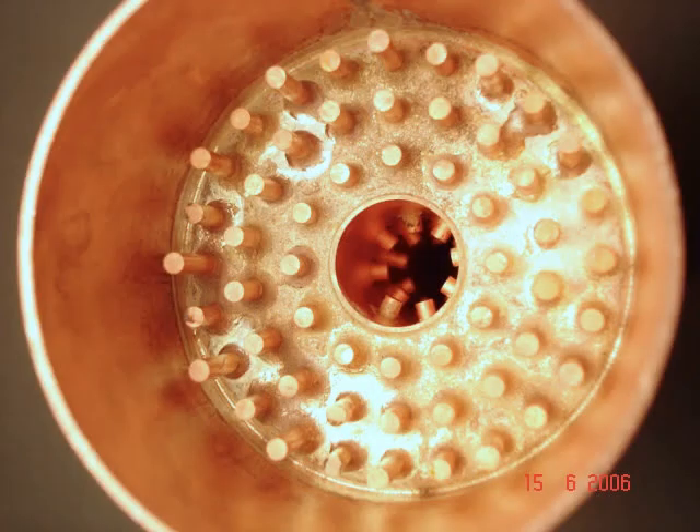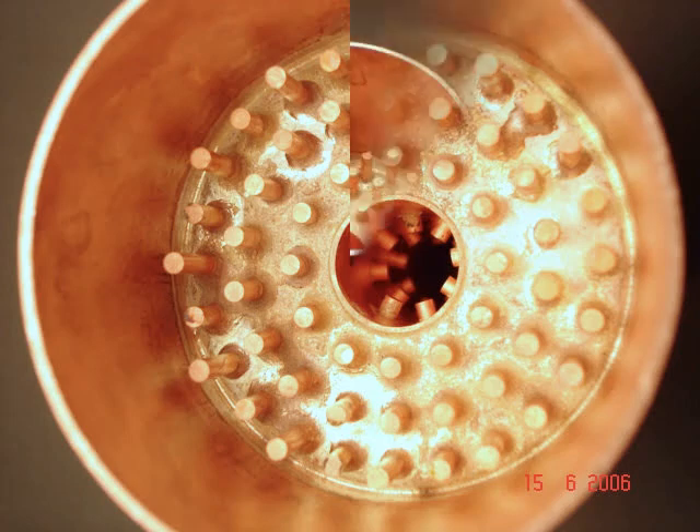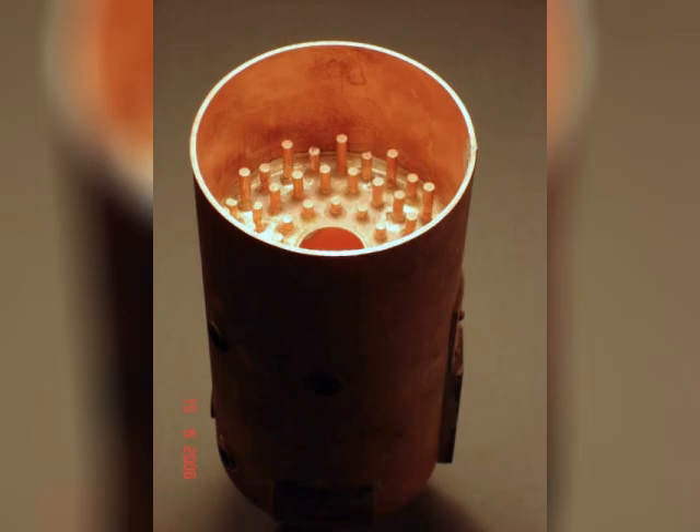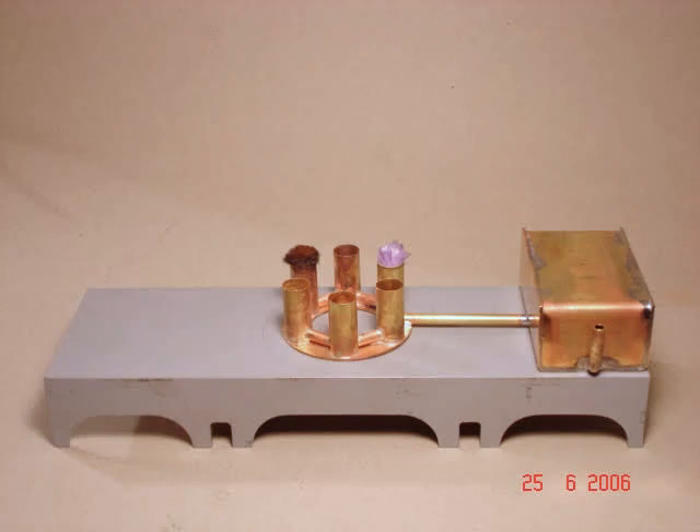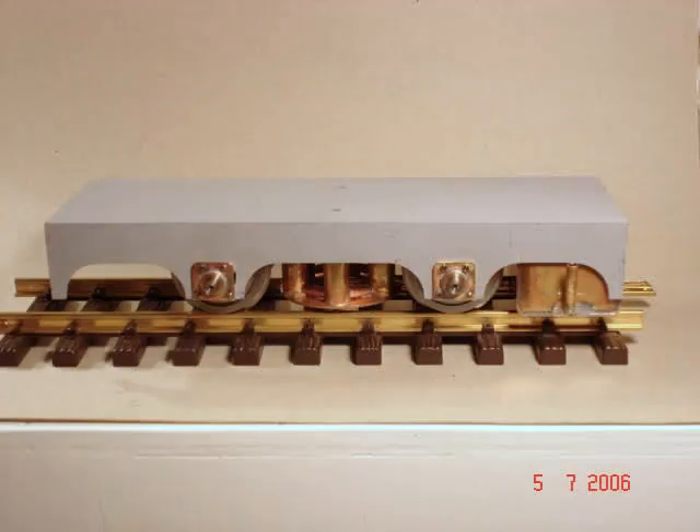Inside the firebox, a mass of porcupine spikes to aid heat transfer to the water. The 6-pot meths burner to fire the large boiler. The completed burner assembly sitting on the incomplete frames. These frames are made from 2 pieces of 40x40x2.5mm angle iron, braced together down the middle — the same iron used to make my brazing hearth. I remember brazing them right outside the workshop with a large Sievert 2942 burner. Axles attach to the frames, with the burner just resting on the rails.